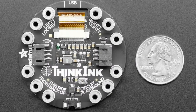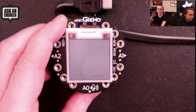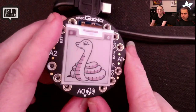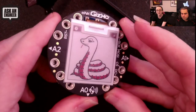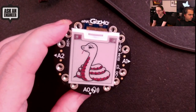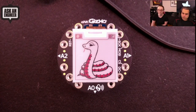It still uses the same overall library code, so if you're familiar with CircuitPython or Arduino you have code for both. One thing to watch for with e-ink displays: they take a while to update — this is normal. You can see the flickery, flashy thing slowly bringing in the red and then adding black as well. It's a really beautiful 200 by 200 pixel display with great high-density resolution. When I pull the power it's still on. The red is nice and vivid, the black is very dark with high contrast. As e-paper goes, the quality keeps improving and we'll keep updating our products to use the latest technology.